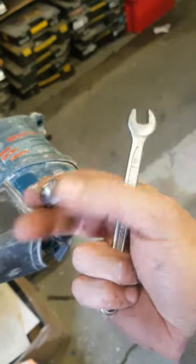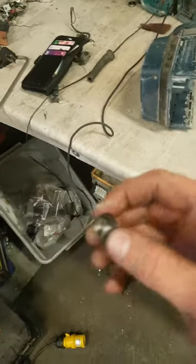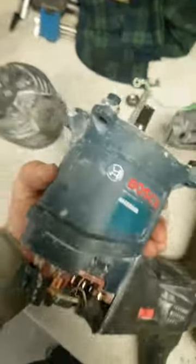That boy there also gives a lot of trouble on these hammers. That's the speed pickup, the wee tacho magnetic pickup. If you ever notice them starting up and stopping straight away again, probably that wee magnetic pickup smashed, needs to be replaced.